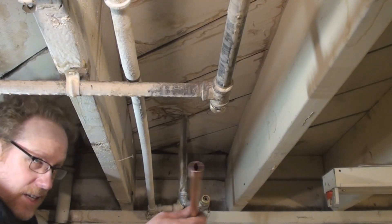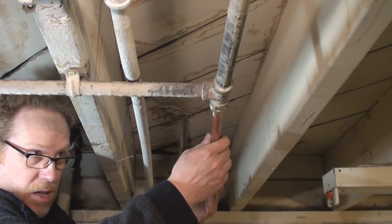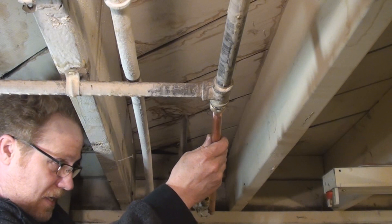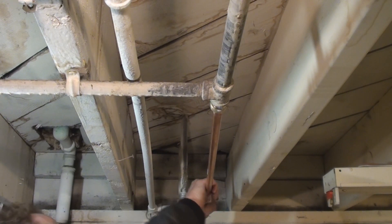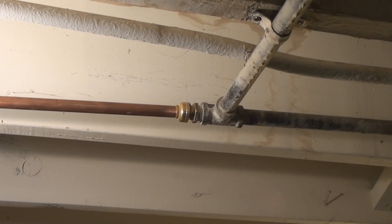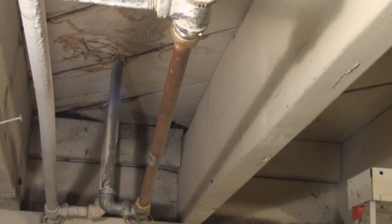The last stage is to make the connection between the two. You're going to make a one-inch deep connection into these SharkBites until you hear a click — and there it is right there. That one's done too. And that's what it looks like. Pretty good, eh? Pretty quick, pretty easy. No leaks — I like that part.